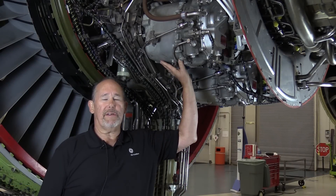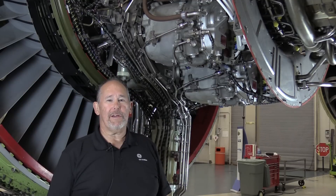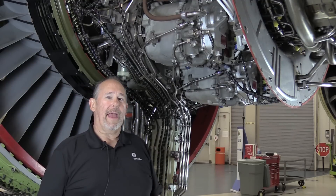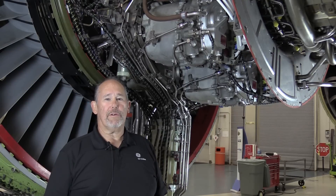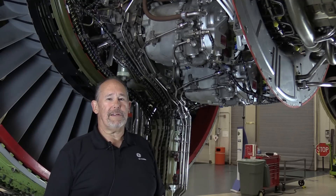Hello, my name is Jeff Goodman with the Customer Technical Education Center and I'm here to talk to you about the installation of the variable frequency starter generator on the GENX-1B. The installation can be made easier with less chance of damage to the preformed packing of the VFSG spline drive shaft and to the carbon seal in the accessory gearbox by using the spline alignment tool. This tool helps you to pre-align the VFSG with the engine accessory gearbox, making installation easier and quicker.